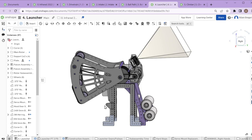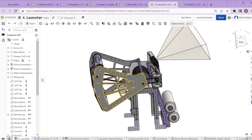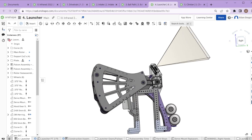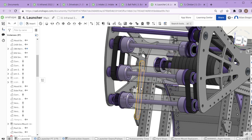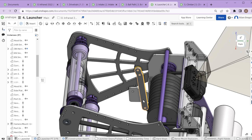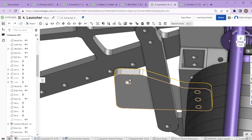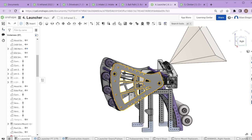From testing we found that with the back rollers and the actual goals and balls, we were able to shoot quite a bit without changing the hood angle itself. We eventually replaced the servos with Lexan bars that physically attached the hood into a specific angle — a single release angle. We added a small plate and standoff to tie it down, locking the hood in place. We were still able to shoot from most of the places on the field that were important for what we wanted to do.